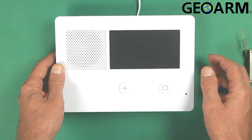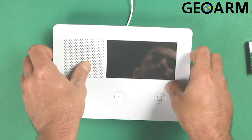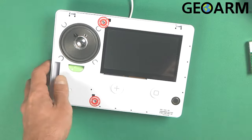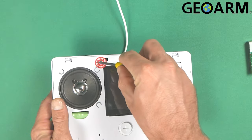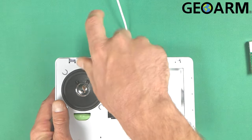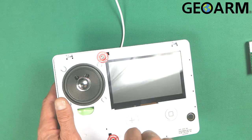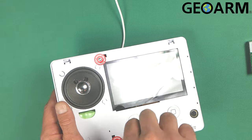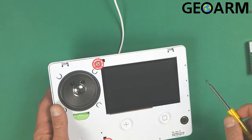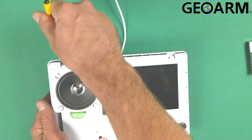What we'll do here is flip this over like this and pop the cover on the actual 2GIG. There are going to be two screws on the inside that you'll need to back out slightly. They are spring-loaded, so once you get them backed out enough they'll come loose, and then you should be able to lift this device off by entering the screwdriver here and here and pulling towards you.